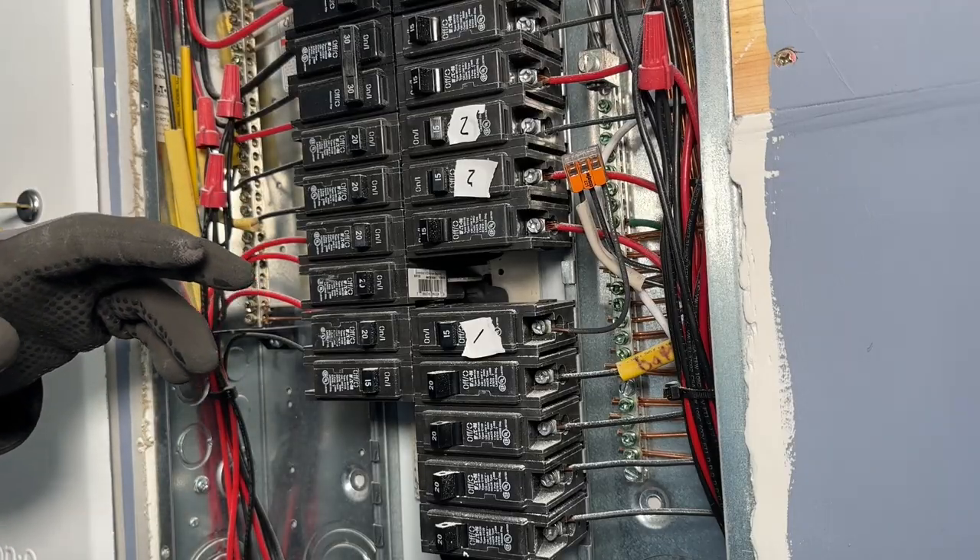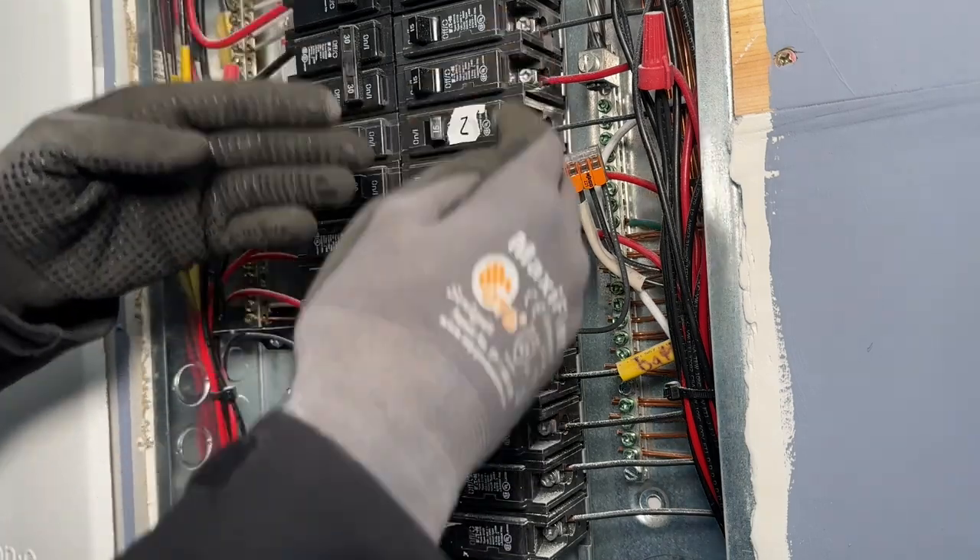Number three is the electrical panel. If you ever need to move circuit breakers, sometimes your wire ends up too short and you need to extend it. Check your local code, but in most municipalities you can use a wire connector inside your electrical panel since it's considered an enclosed junction box. The inline splice is perfect for this — it runs perfectly inline, extending the hot wire down to connect with a circuit breaker further along the bus bar. Because you may need to do this multiple times, the compact size of the inline splice is crucial so you don't fill the entire panel with connectors.